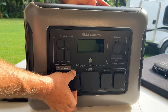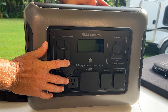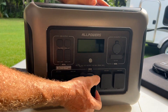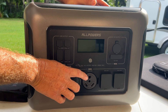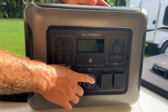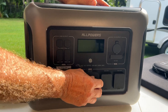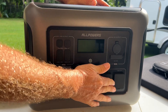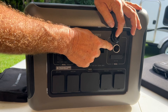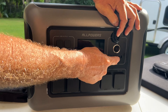It's great for power outages, camping, and RVing. We have four 20-amp, 120-volt regular outlets — you can see it has both 20-amp and 15-amp capability, and there are four of them. You also have a 20-amp RV 120-volt outlet. If you want to connect to an RV with a 30-amp outlet, this will work but it's only 20-amp capable. Everything has nice water-protective covers over top. We also have 12-volt power — your standard 12-volt cigarette lighter outlet and 12-volt plug connectors.